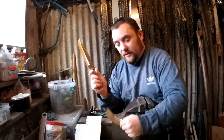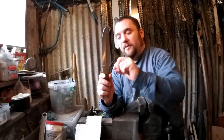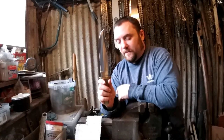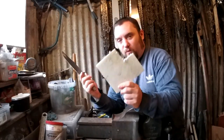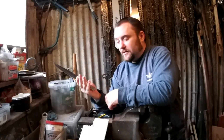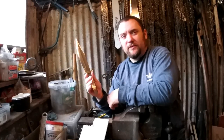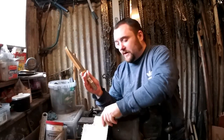Using some 5mm brass to do a bigger guard that goes up at the back, down at the front, like a traditional Bowie guard, solid brass. And I'm going to do an experiment in using some white chopping board, HDPE, to do some white handle scales as a very cheap alternative to mother of pearl or whatever. You know the nice white handles you can get, bone handles. Using a bit of chopping board, we'll see how that comes out.